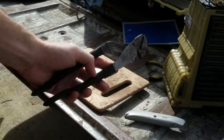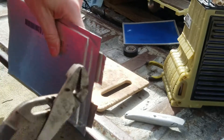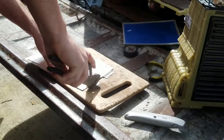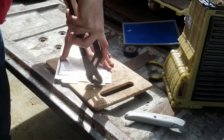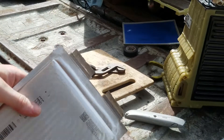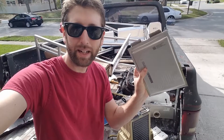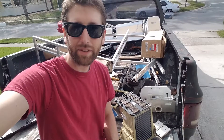The last thing I'm going to show you with the pliers is how to flatten out the tip of the tabs — you can see they're kind of bent and wavy. If you take the back end of the pliers and just roll the sides, the tabs will be flat. Alright guys, hope you enjoyed that — that's part one of this video series. You should have three cells by now. Go ahead and stockpile however many cells you're going to need for your project, and in the next video I'll show you how to connect them together.